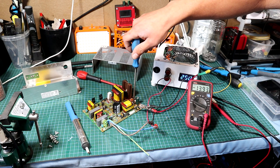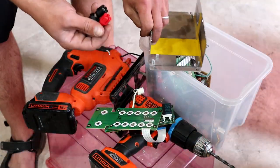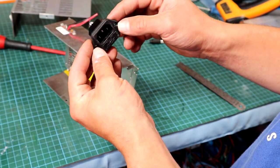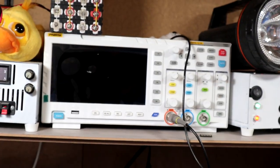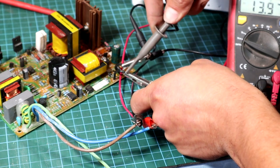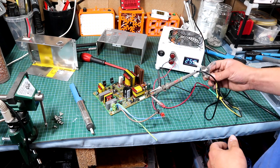Before putting it all back, I want to add some binding posts instead of the two loose wires, and for the back I want to add a C13 connector to use with the same power cable I use on all my PSUs to make them universal. First let's connect to the oscilloscope to see the waveform. We can see it's quite noisy, meaning it has a lot of harmonics. I'll try adding a load to see the waveform better.